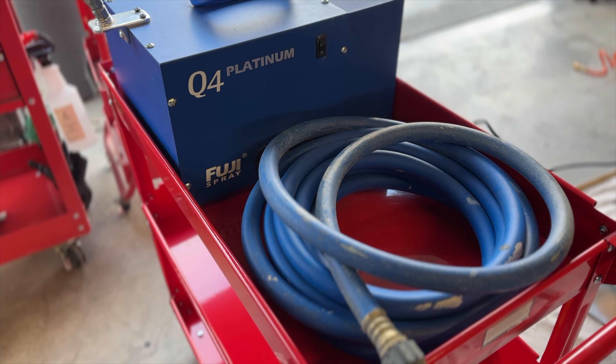I took a little break for two reasons. One question I get asked so often is: you just painted and now you're sanding — aren't you concerned? No, I'm not. I'd rather paint first and sand second so that I don't have to tape off anything freshly done on the top in order to paint. Because I spray, that is an issue. Also, I wanted to show you — that's about the amount of sanding dust I get with my sanding system. I'm using my Festool CT MIDI dust extractor along with my Festool sander, and the combination really controls the dust. I can just blow this off or wipe with a microfiber cloth and I'm done.